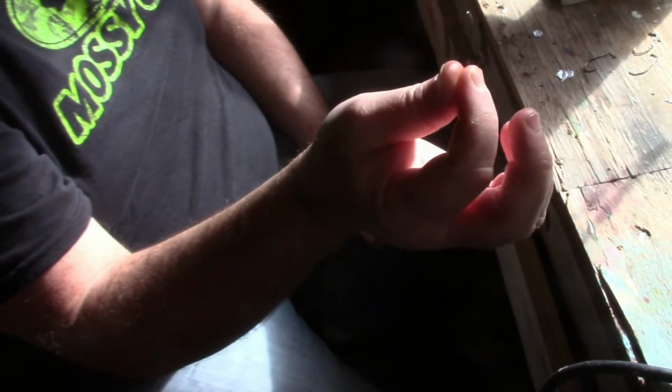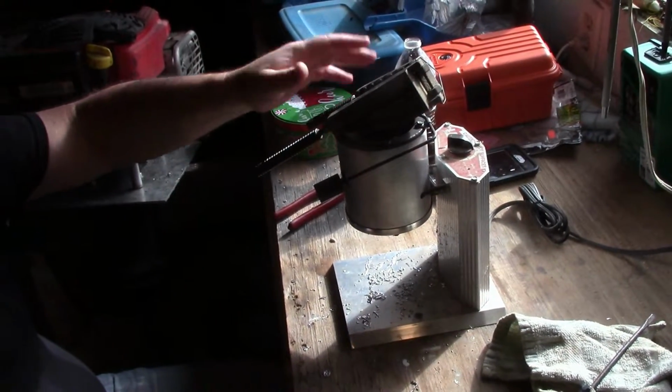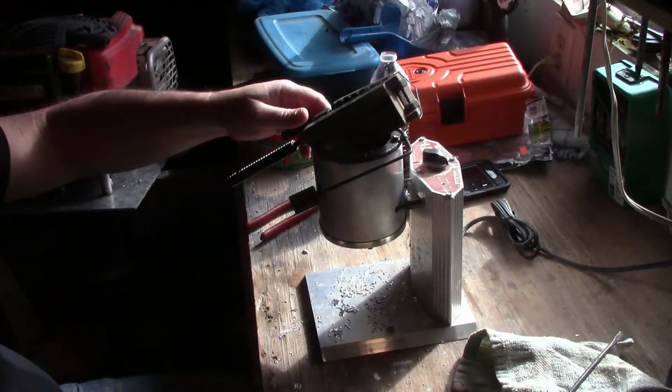But then we're going to be pouring some 1/8 ounce and 1/4 ounce right here. We got the heating pot going right here, the lead pot. And always remember to put your mold up on it, let it heat up. That'll keep your lead from sticking and stuff, and let it form good when you pour it.